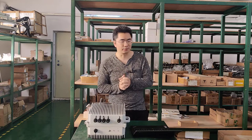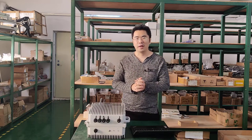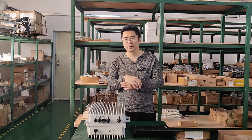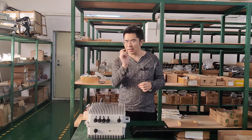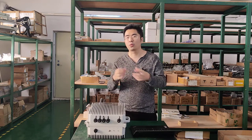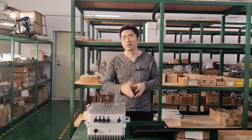Actually, you need to pay very close attention to stability. I had a bad experience with one of my customers — they bought a pole without considering the wind properly. When they installed it and mounted the camera, the pole was shaking slightly, and that shaking already affected the camera so it could not see clearly. When designing a pole system for video surveillance, you need to carefully calculate wind load and weight to ensure stability.